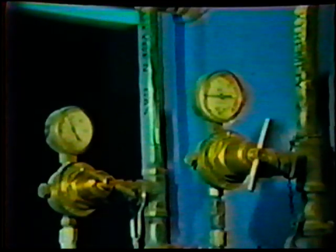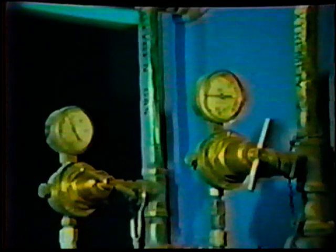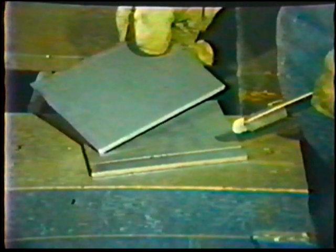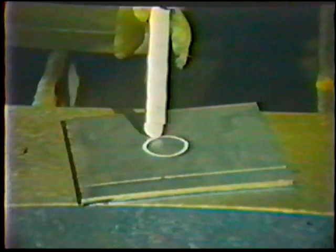Check the cutting tip carefully to make sure that the tip orifices are clean, then set the oxygen and fuel gas pressures. Before positioning the workpiece, mark the lines that the cuts will follow along the longer edge of the plate, about one quarter inch in from the edge, and then draw a circle one inch wide in the center of the plate for the hole cut.